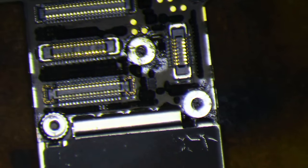I'm just going to wick off the solder on these bracket pads. This will make it a lot easier to peel that top layer of the board away. I don't know if the microphone on this camera can pick it up, but I really feel for my wife right now — I can hear our new daughter screaming in the background.